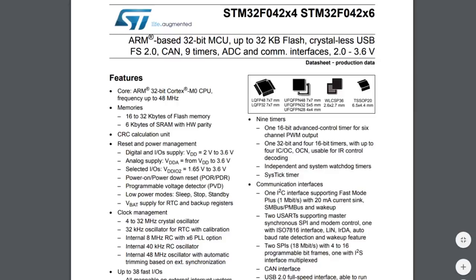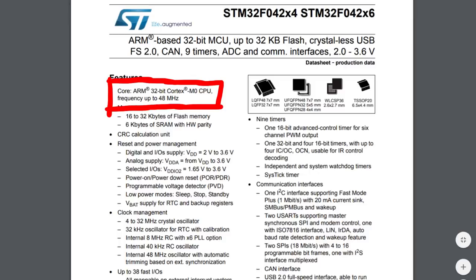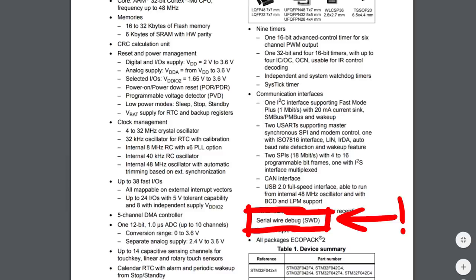This is a typical ARM 32-bit Cortex-M0 microcontroller running at up to 48MHz. It has 16 to 32KB of flash memory — persistent memory where program code is stored — and 6KB of SRAM, so not much RAM. Interesting features for us include that it can speak USB, it has two serial connections, and it supports the Serial Wire Debug Protocol, SWD. Stuff like that is obviously very interesting for research.